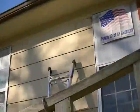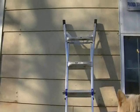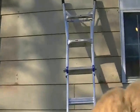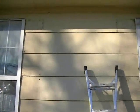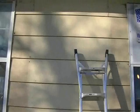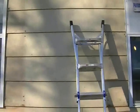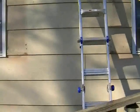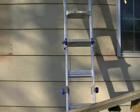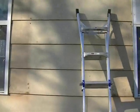The next step to building my panel on the side of the wall is to find the center so we can work out from it, and then determine where we're going to put our holes through the wall. Since these windows are pretty high up, I'm going to try to match the bottom of the panel with the windows so it gives it a nice appearance. There's a line at the bottom of the window where the clapboard goes straight across, and I'm going to use that as the basis for the bottom of the solar collector.